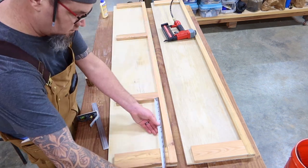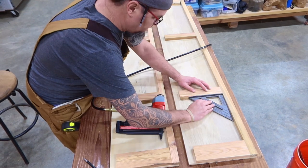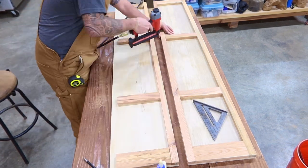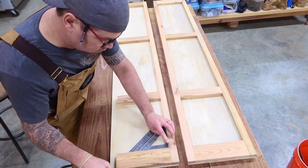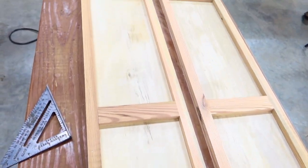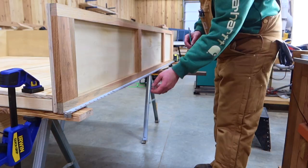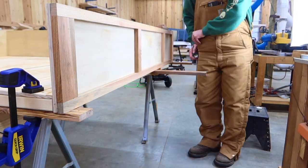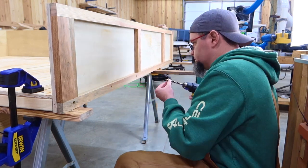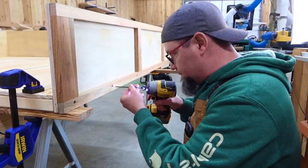The top and the bottom are going to be three inch wide material, while the two middle slats are actually going to be two inch wide material. All of the dimensions will be in the description. To move on, we throw on some glue, put in some brad nails, and this is where we're at. With the sides put together, we're ready to attach those to the backing. The sides will attach to the outside edges of our backing using three and a half inch long screws. I'm making a countersink so that I can finish this off with some plugs.